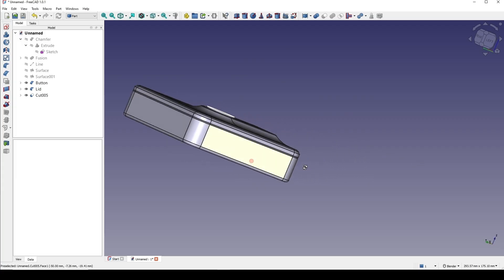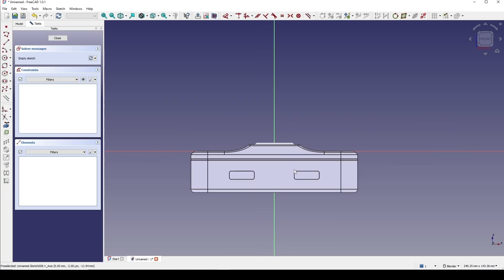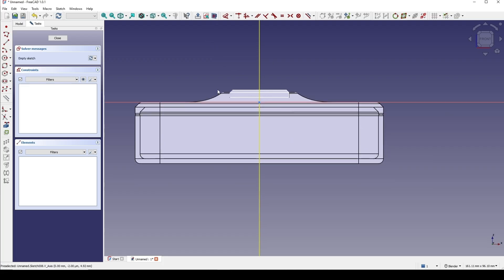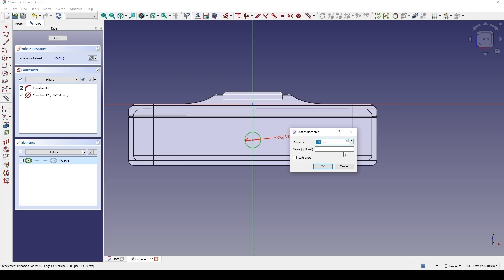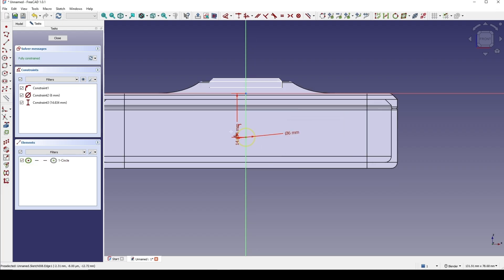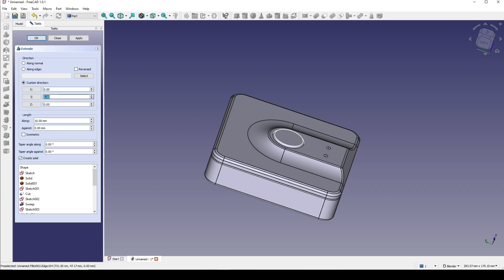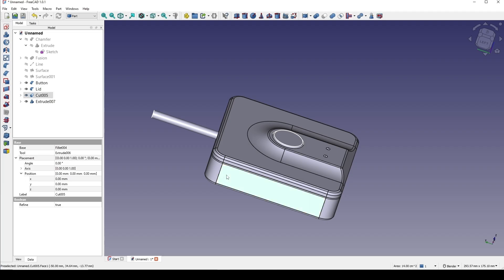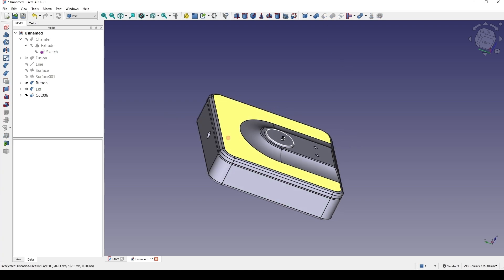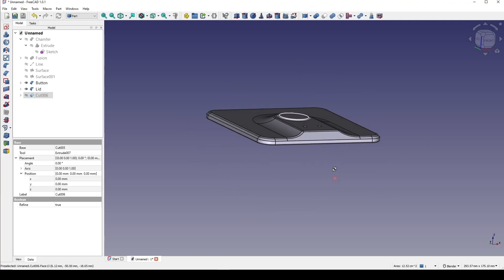In the back I also need a small circle. I create a new sketch on the front view, view the section, and create a circle with diameter 6. I set the distance to 12. I extrude this one in the positive Y axis to 100. Then I control-select the cut and go to cut. That's it for the tutorial — thanks for watching and see you in the next video.